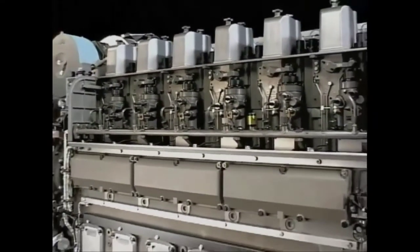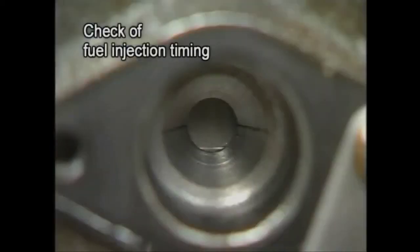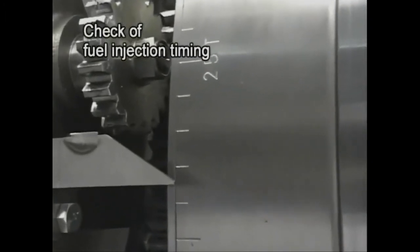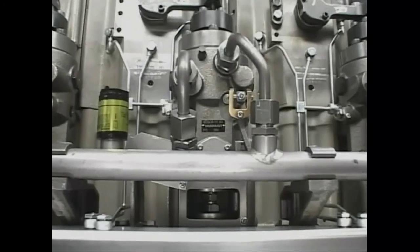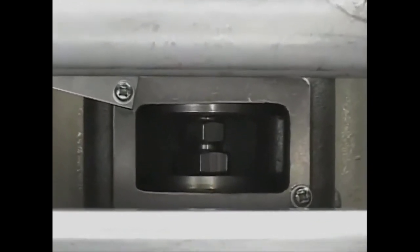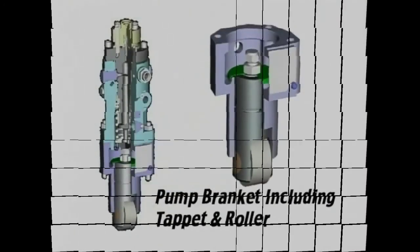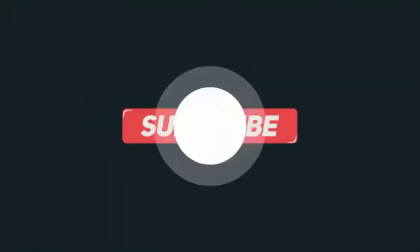The check of injection timing is as follows: Turn the flywheel and align the marked-off line on the body of the fuel injection pump with the plunger guide. The scale graduation pointed out by the flywheel pointer at that time indicates the fuel injection timing. Also, overhaul the pump driver every 8,000 to 10,000 hours.